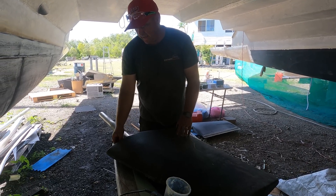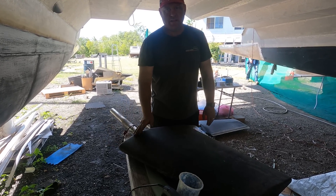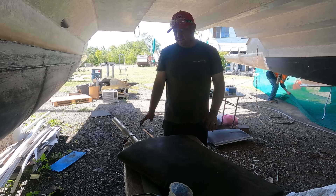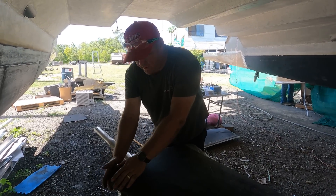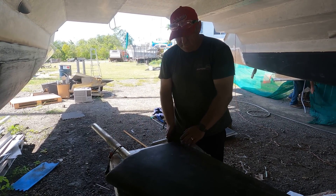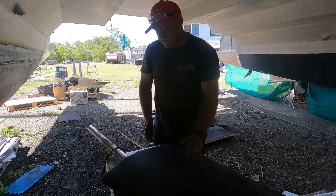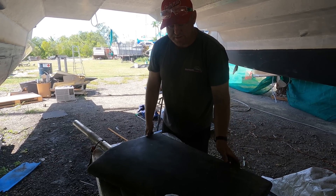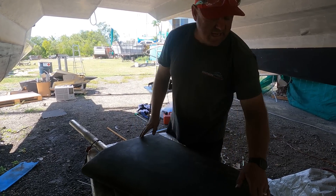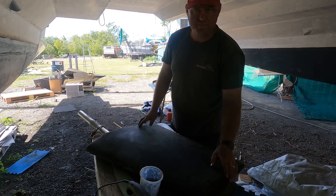At the front here we're going to add another piece. The edge of the hull is a fair way away from where the rudders are, so there's a thing called an end plate effect. The way the end plate effect works is if we've got water going down over the rudders to our nice fine entry point and coming off nicely at the back, it also wants to go over the top and over the bottom when you turn and put it side-on. So instead of having a nice close thin edge for the water to go across, it's got a very big thick edge which is inefficient.